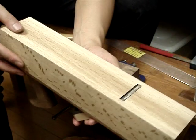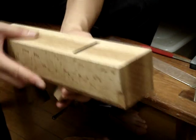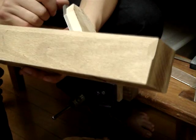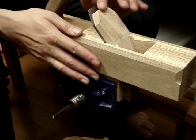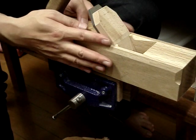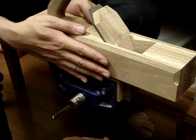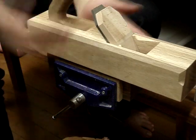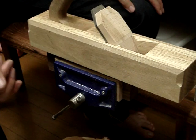To flatten the sole, I basically just took a plane and flattened it out — it's definitely flat enough because it works. The last thing to do is apply a finish. I'm going with just basic boiled linseed oil, wipe that on and give it a few coats. I might put some wax on later, but wax can tend to stick on the sole so I might skip that. So it's done — a nicely working tool, relatively cheap and easy to make. I hope you enjoy making yours and get some good use out of it.